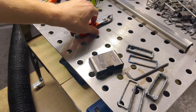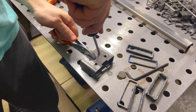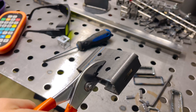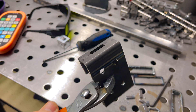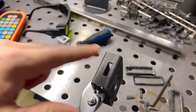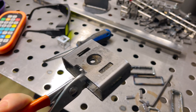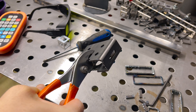Let's see what we got here — it's still really hot. Let's see if these features will just pop out. Oh yeah! Everything looks pretty good, except I can see I should have run the auto centering function before cutting this. These features on the sides are supposed to be centered but they're pretty far off by like a millimeter or two — same on this side. But everything else looks pretty good. Let's try cutting out some round tube.